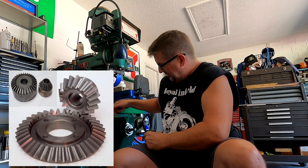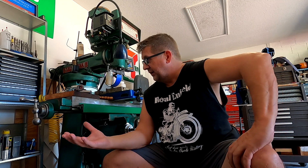The knee gears are a set of pinion gears that mesh to give a 90-degree movement: the shaft goes in, turns 90 degrees, and goes down — and at that 90-degree turn are those pinion gears. For some reason they either used substandard material or built them too weak. The table is rated to lift about 350 pounds, and the knee and table together are about 400 pounds, so that's 750 pounds it could potentially lift — quite a lot for the size gear in there.